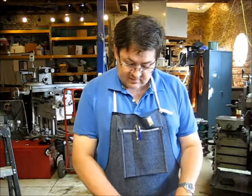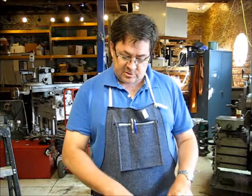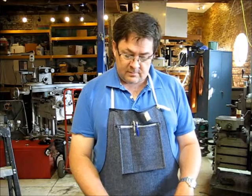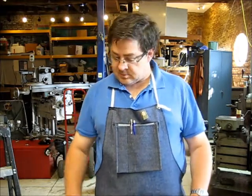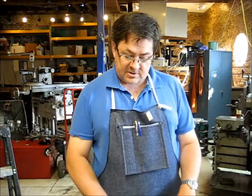You could make these out of brass. You could make these out of aluminum with a little more work. There'll be some soft soldering involved. That's easier to do with brass. Plus, the brass is not going to corrode. Some of the coolant chemicals you use may not be compatible with aluminum, so brass is a safer choice.